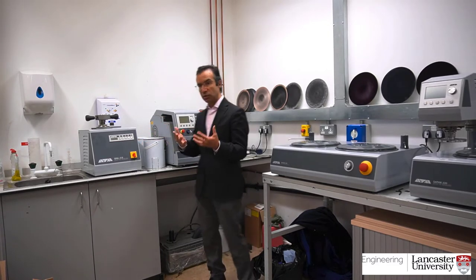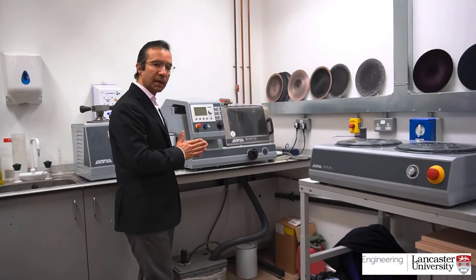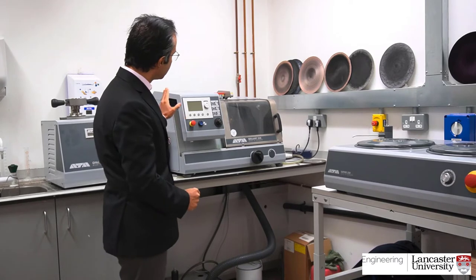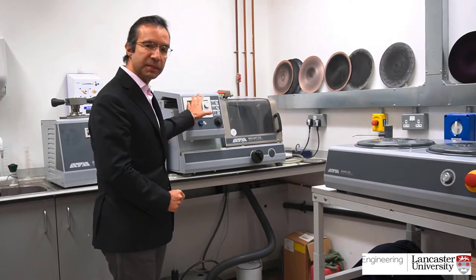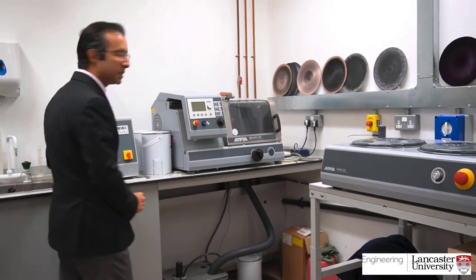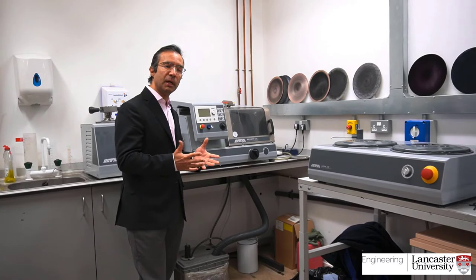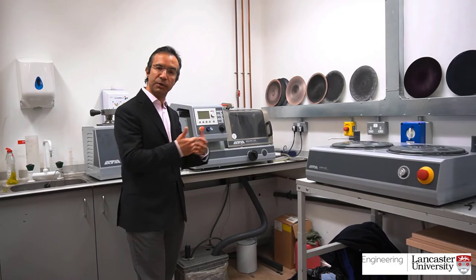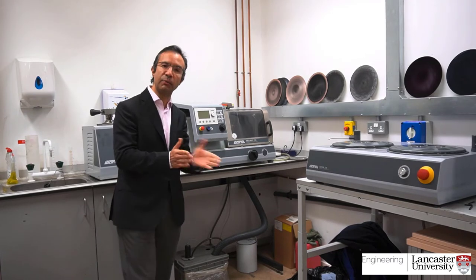And later on, in order to mount them or to shape them appropriately, we have a disc cutter. Many of the samples will come in big chunks of metal, and that metal has to be chopped and flattened. The first step in flattening is to use this precision disc cutter machine. Once the cut specimen that is mounted in bakelite is ready, the surface of it will usually be rough. And what we need to see a metallographic sample under the microscope is the absence of a rough surface — we generally want a mirror-like surface.